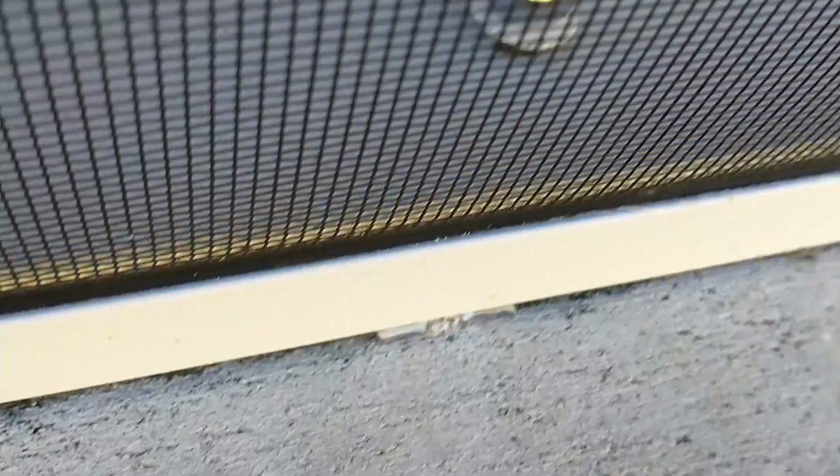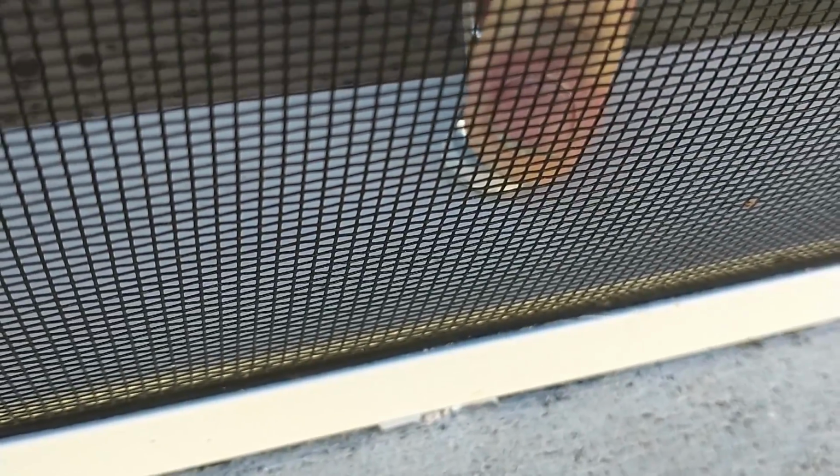We have our second bar in place right next to the screw. Now we're going to tighten both down. We're not going to tighten them very tight, just hand tight so there's enough pressure so those bars won't blow away or get loose. Take a flat piece of material and clean out the trench in between the 2 metal pieces that you inserted.